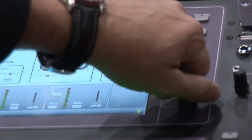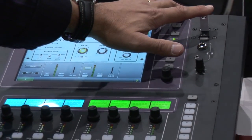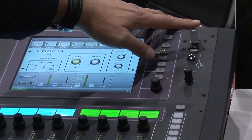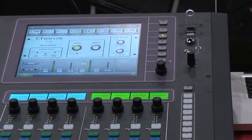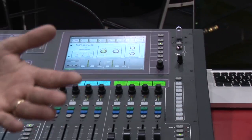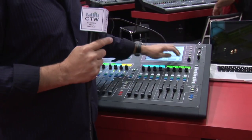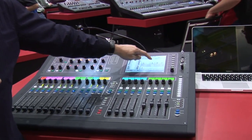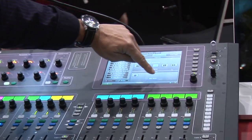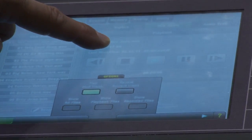New on the GLD is the capability to play back and record to a USB stick. The console recognizes four different audio file formats: MP4s from iTunes, MP3s, WAV, and even FLAC files. Load those on a USB stick and you have an audio transport built in — you can scroll through all your songs, with playback, stop, and record controls. It even tells you how much USB space is left, and you have functions for loop record and loop playback.